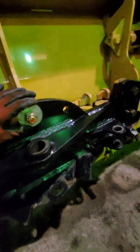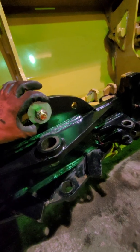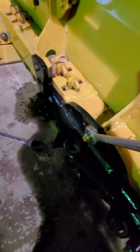This one here, you want to adjust it until you have just a wee little bit of loose on this washer at the top. That's done with the 1 1/16 wrench right here. So the one thing to remember is none of the bolts are tight. None of them are tight, snugged in. You want to take all the play out of them without having them tight.